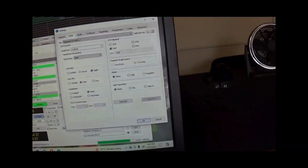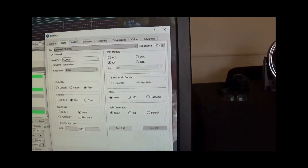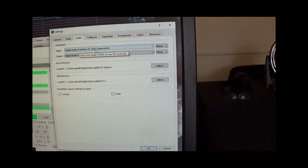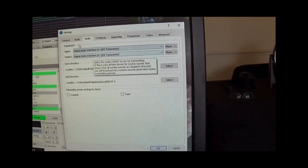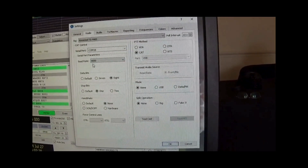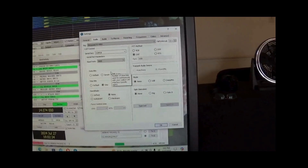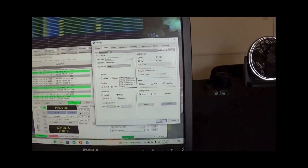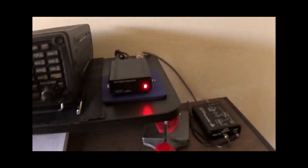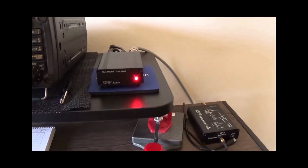You want to make sure these are my settings that work for me. On your audio tab, make sure your sound card is set to the QDX. This is showing COM18, 9600 baud, and you can see the rest of the settings. That works every time as long as I do it in that sequence. Your laptop, your desktop, your situation might be different, but for me that's how it worked. There we go — QDX, we're on the air.